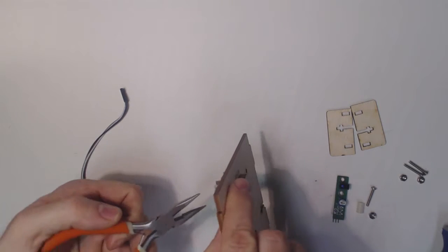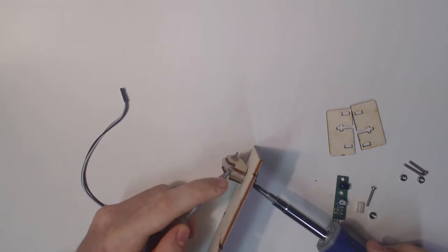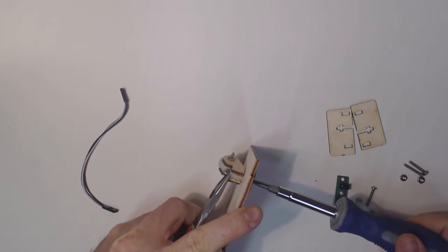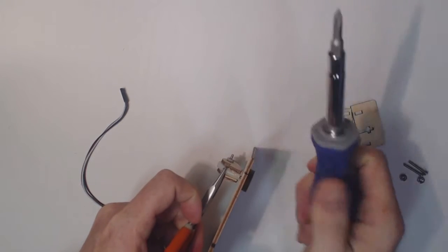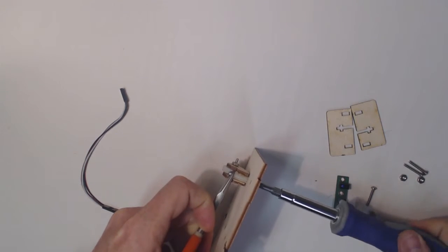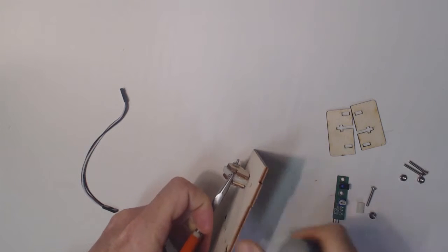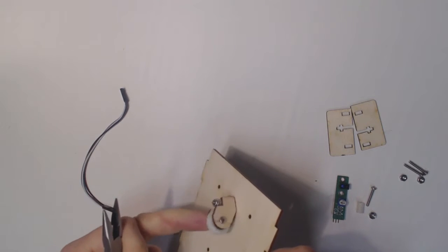Now, the nylon insert nut, you will need to have a pair of needle nose pliers to hold the nut. So I want it tight enough to hold the caster securely, but not so tight that it can't rotate freely. Okay, so it's secure, but still rotates freely.